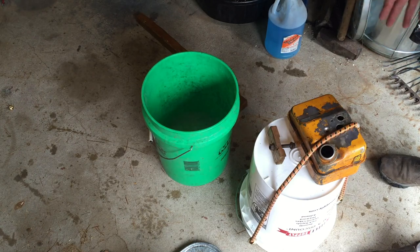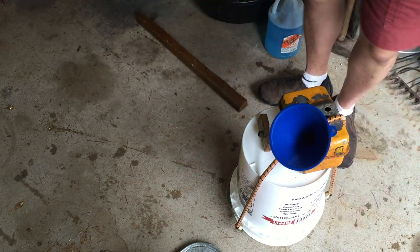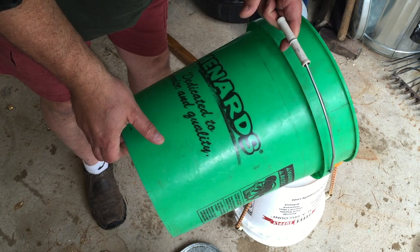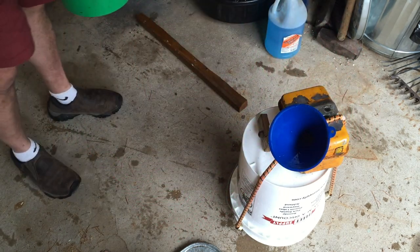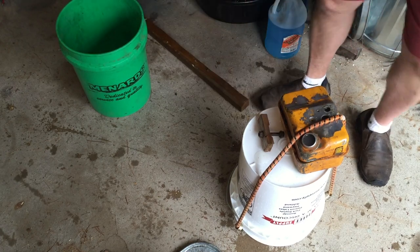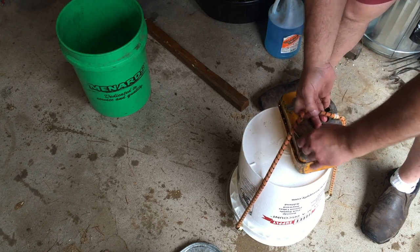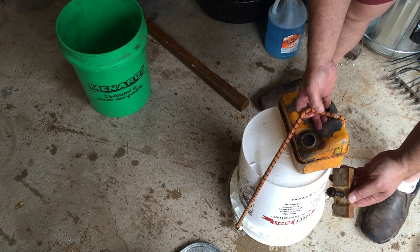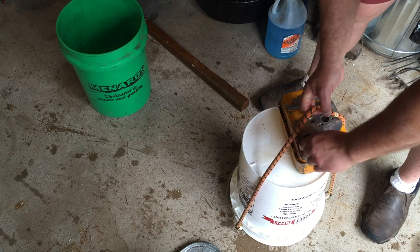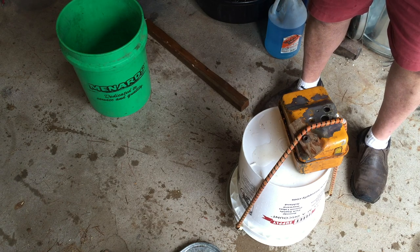You know it's not a project of mine unless we're using bungee cords. We're going to fill up the inside of the gas tank with our freshly made electrolytic fluid until it runs out — perfect, filled up to the brim. This is our sacrificial anode, and the bungee cord is here. I've kind of made a lip here so the wood and the bungee cord attempt to isolate and hold this thing down.